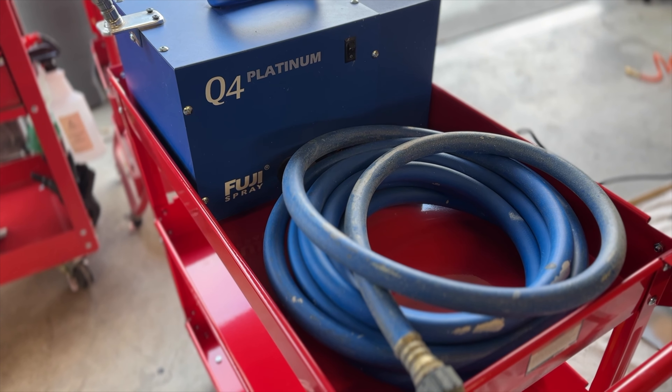I'm going to finish sanding off this finish since I've gotten it started, so we're nice and even and smooth, and then we'll figure out what to do. This squiggle pattern definitely keeps repeating throughout the entire piece, so stain is out. It's unfortunate because it's actually not a bad looking wood veneer — I really kind of like it. But I need some opaqueness to cover that weird pattern, so I think I'm going to do a faux wood look with paint.